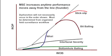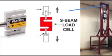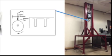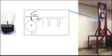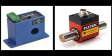This year, the sample will be homogenous sandstone, so the rock strength will be known and we do not have to worry about changing lithology. We will still monitor MSE because we can expect whirl to occur and possibly stick-slip, although it would not be significant at such a small scale. Sensors will be used to detect acceleration and changes in torque. Many of the sensors from previous years will remain the same. Weight on bit will be measured by an S-beam load cell to measure tension in the hoisting system. RPM is measured using an optical tachometer.